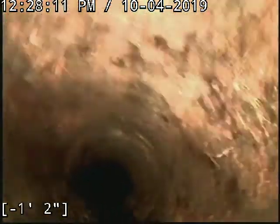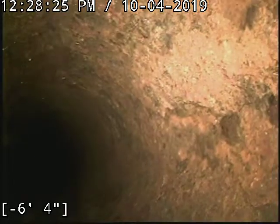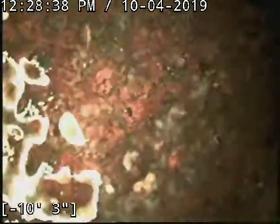The sewer has proper pitch, though it's a little low in one spot. The one asterisk with a sewer liner is if it's got a belly — if it dips down and there's always water sitting in it. That's the one thing that can affect the lining, and since there's water sitting there all the time, you can't really guarantee that repair. We will line through bellies to get to other damage though, like if there's more cracking in other spots.